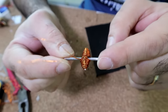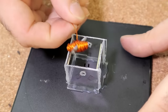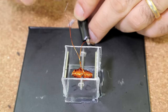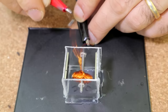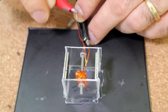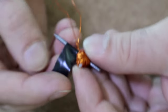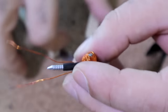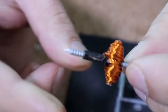So we make something like this. Then we remove the coating from the end of the wires and place the nail in the holes of our stator. You can see that if I pass electricity through the coil it tries to realign itself with the magnetic fields and rotate. Now we put some electric tape on the nail to isolate it, move the wires to a location perpendicular to the coil, cut the extra pieces, and remove their coating. Now we need to make something called a commutator, which is just contacts to these wires and brushes that will touch them.